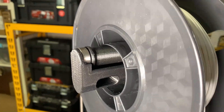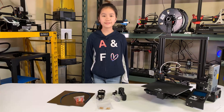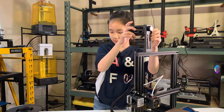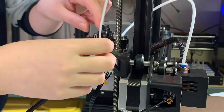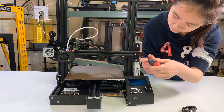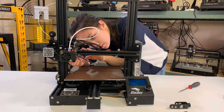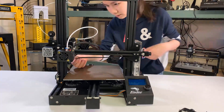These are the items we need to install today. Let's start with the simple ones. For the print surface, just replace the existing magnetic print surface and you're good to go. Next, we will install the 3D printed upgrades. Then we will install the belt tensioners. The installation is quite simple. I will start with the x-axis — just remove the existing tensioner, unlock the belt from the print head, attach the new tensioner, let the belt go around it, and lock it back at the print head.